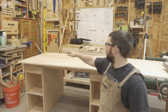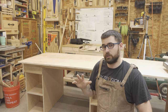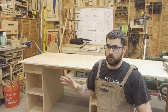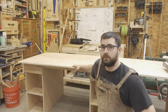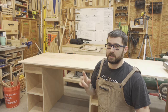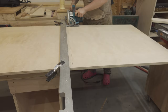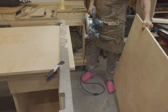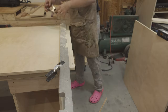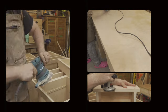I still need to build the entire structure on top of the desk and get all my holes and everything for power drilled. That will be a separate video, probably a bonus one next week, because I don't want to do too many videos all on the same project — I want to keep it to a maximum of probably three parts. Using my giant aluminum bar as an edge guide, I cut the tabletop to 63 inches using my circular saw. I then gave the tabletop an initial sanding and proceeded to sand and route the drawer faces and slides.